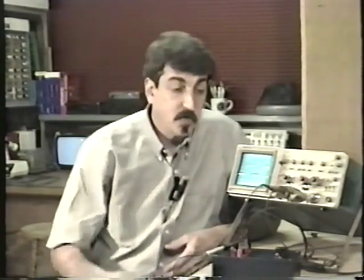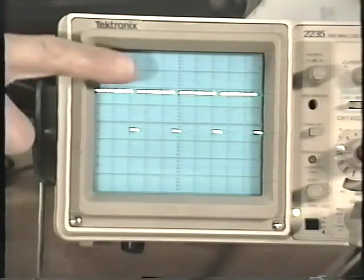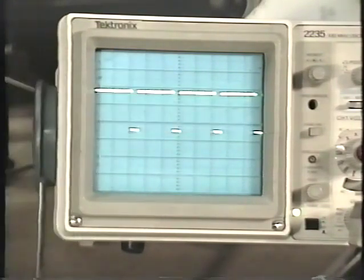Another variation of the square wave looks like this. Here we still see that the waveform is basically square, but we see some very small, very narrow pulses that go in the down direction. You'll see plenty of other waveforms as well, of course. Most of your digital circuits look something like square waves. In something like a monitor, however, you'll be seeing all kinds of interesting waveforms, and we'll be taking a look at some monitor waveforms toward the end of this lesson.